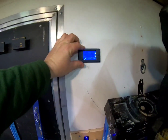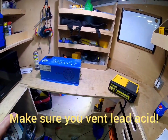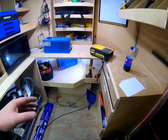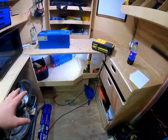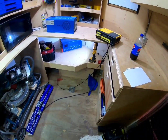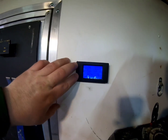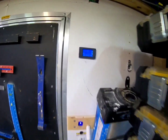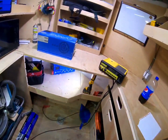There's a battery monitor wired up just to show me voltage. With lead acid deep cycle batteries, you do not want to drain them past 50% of capacity. Even though I have 460 amp hours, I can really only use 230 of them — any more and I risk permanently damaging the batteries. These cost $115 plus tax each, so I don't want to do that. The manufacturer says don't bring them below 12 volts. Right now we're at 12.09, so I'll be charging tonight. I'll turn the inverter off now.